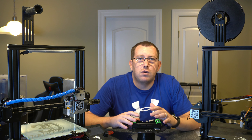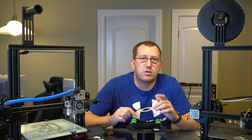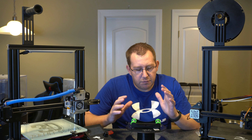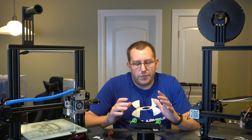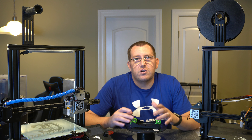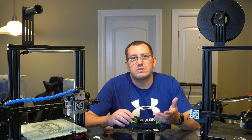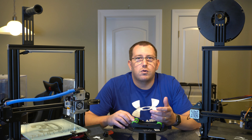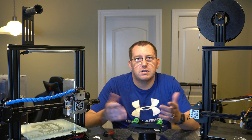Overall, if you're having any type of ghosting issues or starting to see slippage on the extruder, I'd really recommend looking at an external spool roller. Or if you're considering a dry box, I'd buy one of these and just make the dry box yourself, rather than buying a pre-made one, which is more expensive.